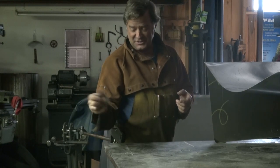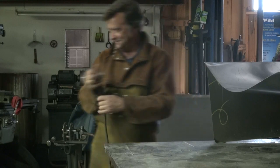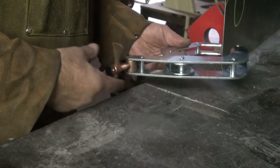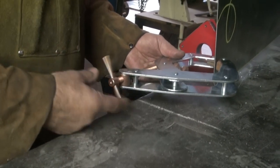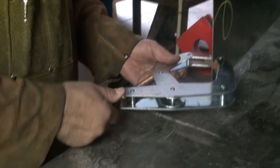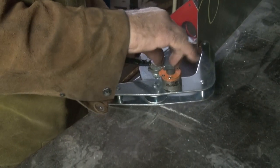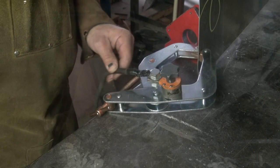I don't have aluminum magnets. But I do have clamps. So all you need to do is just clamp on your work — anything that you can get your clamp to stick to. Now you've got a good ground, now you're safe. Nobody else is going to get shocked, and you can get your work done.